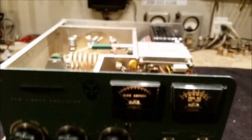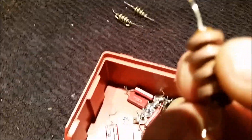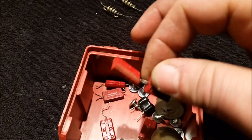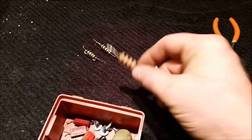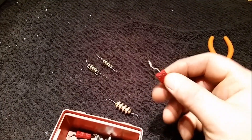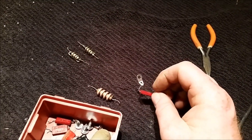I did a bunch of different things in here. I went in and repaired a bunch of stuff. This is part of your plate chokes, or your grid chokes, on the bottom of the amplifier. I left this little eyelet on there because you were telling me how one of the tubes was taken off on you, and it's taken 100% of the punishment. Well, one of these chokes had opened up and left the grid open. And this capacitor wasn't even attached to the ground, sitting or floating in free space.